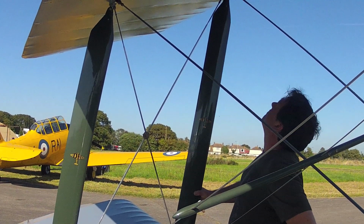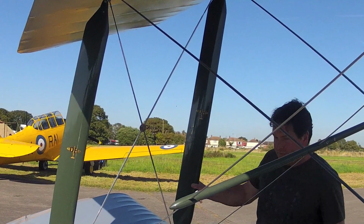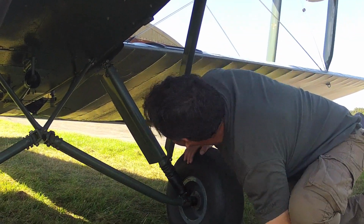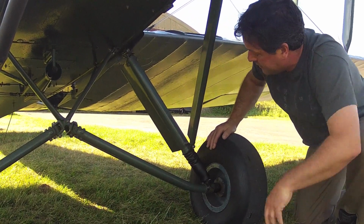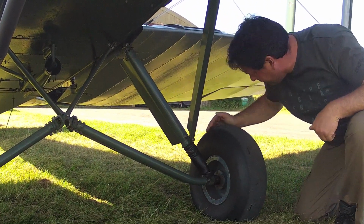Remember that the undercarriage gets a severe beating. If the aircraft has been heavy landed, around the centre section of the undercarriage and the wing attachments is where it's first likely to show, or in slack flying wires.